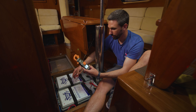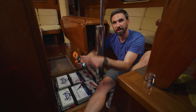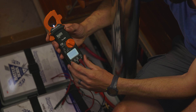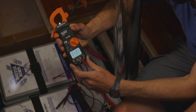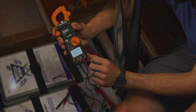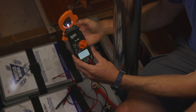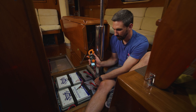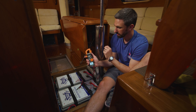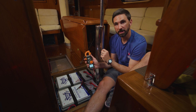The other very important parameter is amperage — that is how fast the electrons are moving through the circuit. In amperage mode, I select DC amperage and re-zero out the meter before using it. Now I'm ready to clamp this over a wire. This can be your alternator output, your solar input, or really any specific thing you're trying to target.